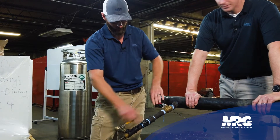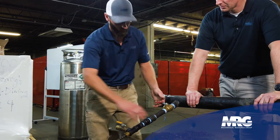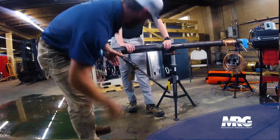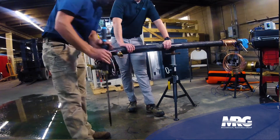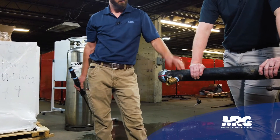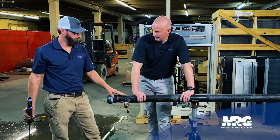Once we're backed out past the valve, we're all live to here. So what we do is shut our isolation valve, making sure we're back in here, then release our pressure here. At that point, you take your hot tap off, and now you have your supply or return — whichever one this is — already with an isolation valve ready to go.